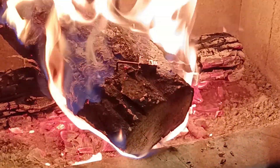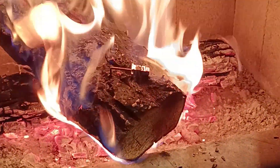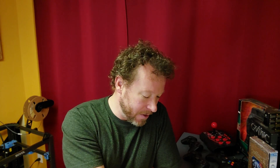In order to see why there was filament coming out of those holes, I needed to make sure that the entire heating block was clean. I took the nozzle off and then naturally threw the heating block in the fire — to burn off all the excess plastic. I know, the environment and all, but hey, you've got to do what you've got to do.